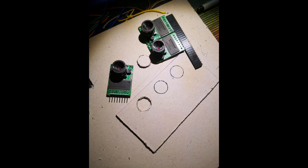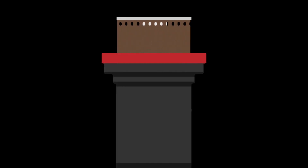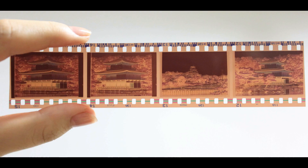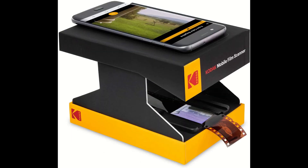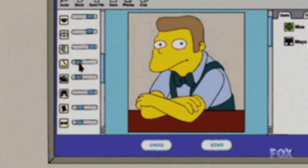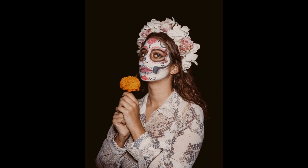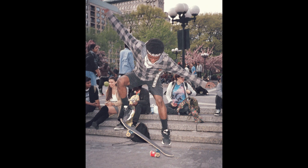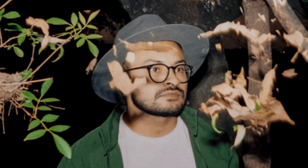Now let me talk about the 3D camera that I made. The process of making wiggling animations from any of these film cameras is a bit of a struggle. While a film has limited space and the camera has multiple lenses, you can only have a limited number of frames on the film. After you finish taking pictures, you have to go through the proper chemical process to end up with the film strip as negatives. When the chemical process is completed, you are ready to scan them. You need to scan negatives with a scanner or a camera to make a digital copy. Then a photo editing software that has the functionality to generate GIFs or video is necessary to edit pictures and produce wiggling animations. I aim to avoid development and scanning processes by making such a camera — I can save money from chemical kits, take as many pictures as I can, and have the results in minutes.